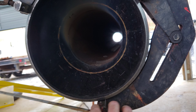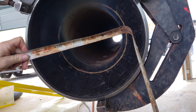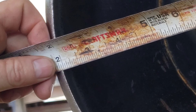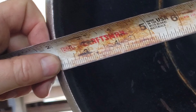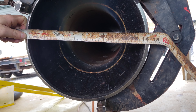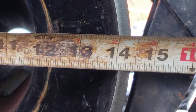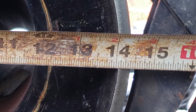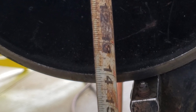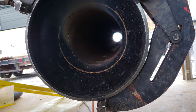Alright, so the first thing I do is, whichever side's the biggest or the largest, I'll measure it. I always burn a couple inches so we get a good measurement. Measure right at the edge of the bevel — whatever the widest point is, that's exactly straight across. We're about 14 and 1/16th. Let's check up and down to make sure it's about the same.